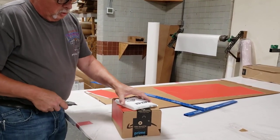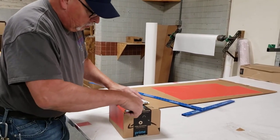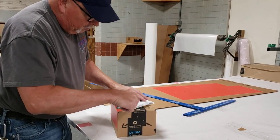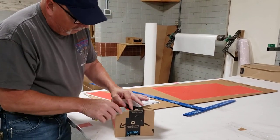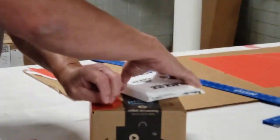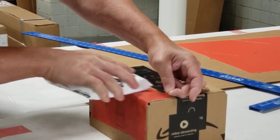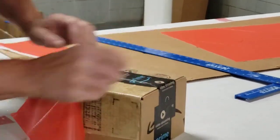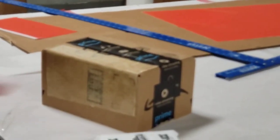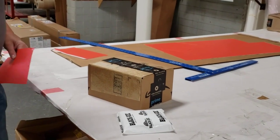This is an ice brick like you would use in your cooler for a summer picnic or camping. You just chill that corner a little bit while you're doing this, and when you get it you'll see it pop — and there's the resin popped. Now you've got a place to pull the poly, so you just cool it down a little bit more, then you peel it really fast, and now you've peeled the poly off and your film adhesive is on there, ready to bond.